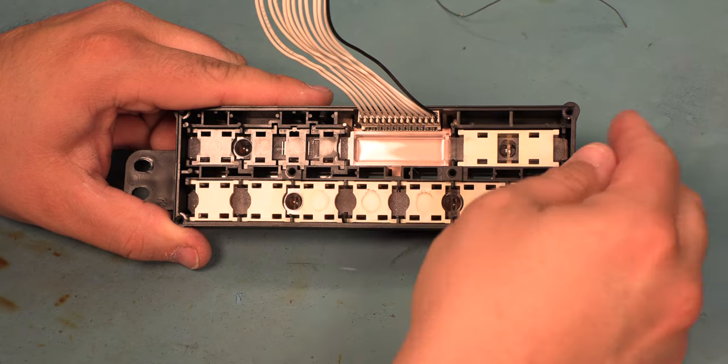and add a little bit of fresh solder. The flux is going to help that solder to flow a little bit better, and it helps with thermal conduction. Okay, we'll just rock the capacitor back and forth until it drops free. We're going to use our vacuum solder removal tool to remove the solder from each of the holes for that capacitor.